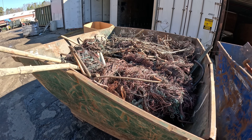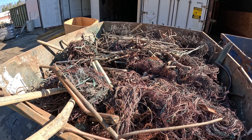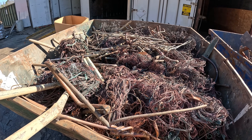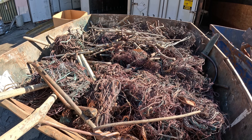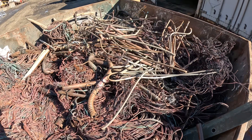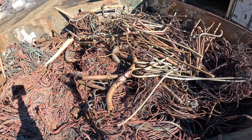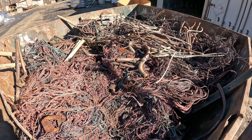Typically speaking, we're making four grades of copper here at our yard, and this is an example of our number two copper. This is a slightly lower grade than the number one because there's more contaminants and it recovers less. This material is made up of wire, tubing, and plated material like silver or tin-plated material. You can see some of this tubing has paint on it and solder joints, which is why this material is worth a little bit less — it has more contamination than the number one copper.